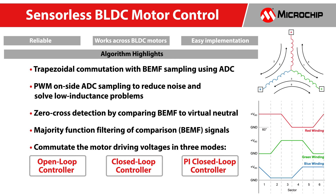These features in the PIC32MM help implement a reliable sensorless BLDC motor control solution. The control algorithm is based on application note AN1160, which implements the trapezoidal commutation of a BLDC motor in sensorless mode by measuring the back EMF. The exact point of commutation, the zero-crossing event, is determined through a simple majority detection filter implemented in software.